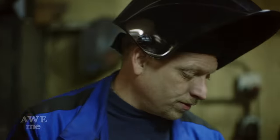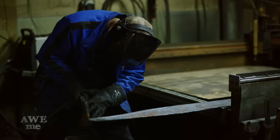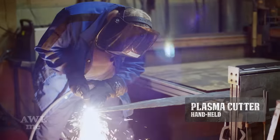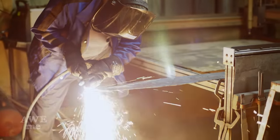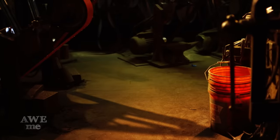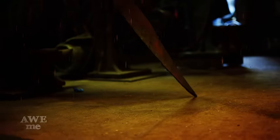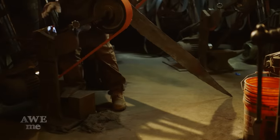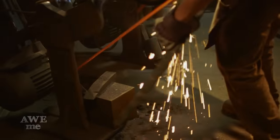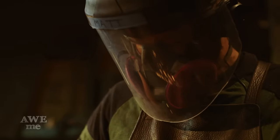The blade is rough forged out, and I'm going to go ahead and use our hand plasma torch and cut the clip point off for it and make it a little easier on the grinding. Then I carefully removed some material from the edge and the spine to create the desired profile before edging.